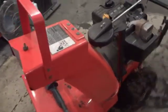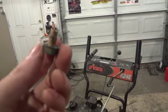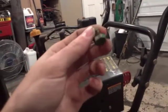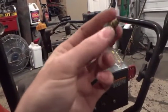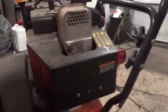Alright, so I've gone ahead and pulled the carburetor bowl off, pulled the jet off. I figured I'd make this video every once in a while, because I get asked millions of questions on how to clean a Tecumseh carburetor bowl. This right here is just a regular smart carb, is what I like to call them. Reason being, this one little jet here is just one jet and you just bolt it into the bottom of it. There are other ones where there's two little needles, something like this one over here.